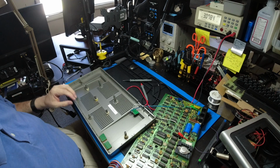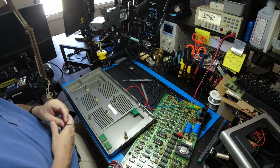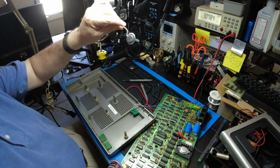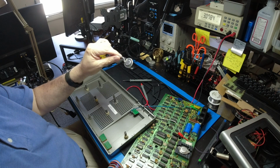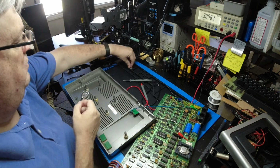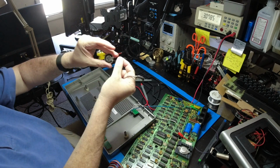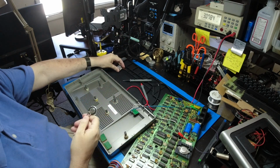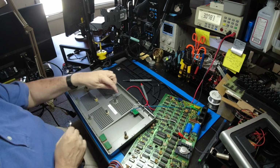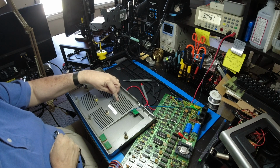So one of the last things you're going to need is a little speaker. We have these little piezo speakers. They're 8 ohms, 2 watts. They come with a little red and black set of wires on them. Just desolder them and get a longer piece of wire. And where I'm mounting them is right here behind the standoff for the motherboard. There's plenty of space right there.